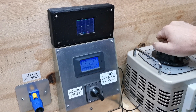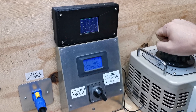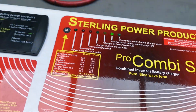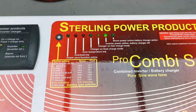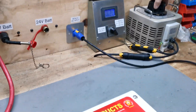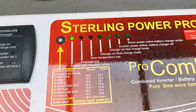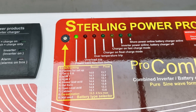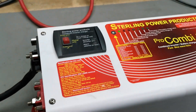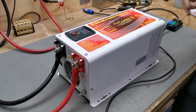However, if we give it some load — maybe a bit more — there you go. You can see quite happily that we gave it about 300 or 400 watts, which is typical for a fridge that's kicked in. It'll take a huge amount of power and then drop right down. As soon as your fridge is disconnected, it'll drop back down to its power saver mode, taking once again a very small amount of power to run the unit. As I said, this is only really helpful when you've got an AC-powered fridge, not a DC 12 volt fridge.